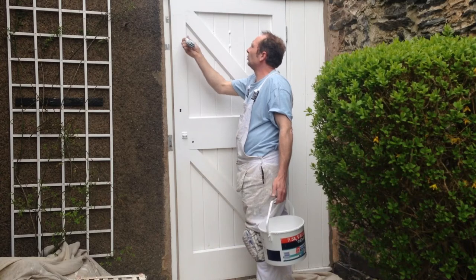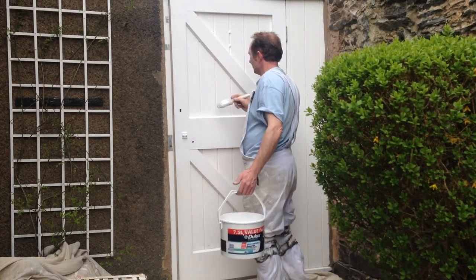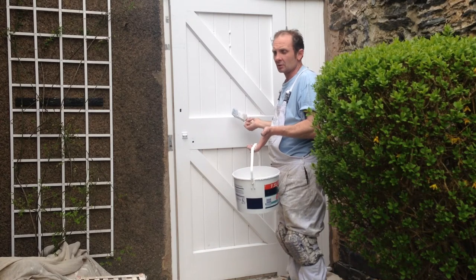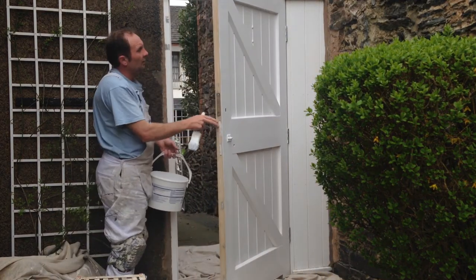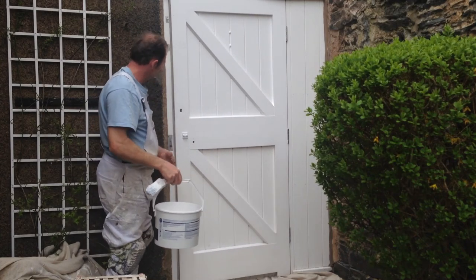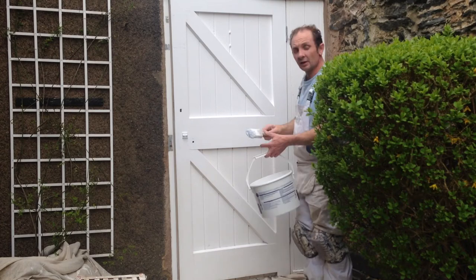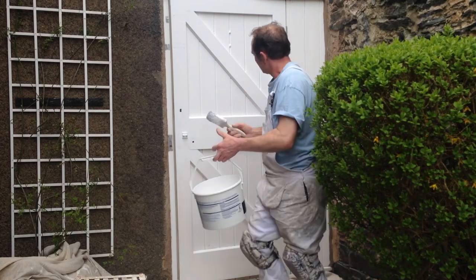Where these bolts and chains have been, when it dries off, probably just give that another coat. If you get it in quite a bad state, you might want to double undercoat it, then gloss it. You can even put two undercoats and two glosses on — it's always better to have that extra coverage. Don't forget you need to do the edges, top, etc. So that's basically the procedure for undercoating the gate. Now I'm going to continue undercoating the front and back, do the bottom the same, and then I'll get on with the glossing.